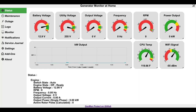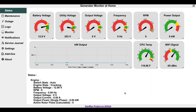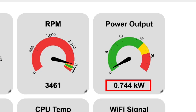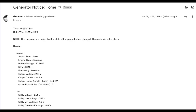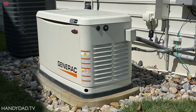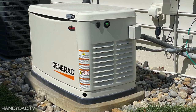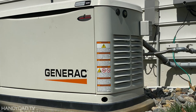The last step was to remotely test the generator and transfer switch, which can be done from the maintenance tab in Genmon. The generator started right away, and you can tell when the transfer switch kicked on when the power output rose to 750 watts. The best thing about Genmon, though, isn't the pretty gauges — it's the email notifications that occur anytime something changes about the generator. If you do install Genmon, please leave me a comment and let me know your thoughts, and be sure to throw Mr. Yates a couple of bucks through his PayPal donation, because it really is pretty awesome software.